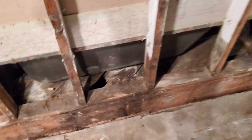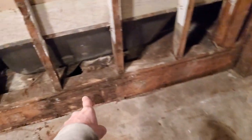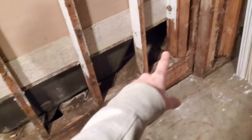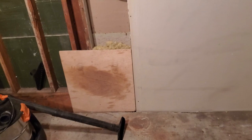Anyway, I didn't really showcase that for that reason. Let me give you guys a quick overview. You'll notice we've got some drywall right here — this is temporary. I'm going to take it off and insulate in there. I had to keep mice from getting out. There's a little gap in the garage door; a mouse could easily come in, get up into the crawl space, go up the basement stairs, and get into the house. So I temporarily put some drywall here and some batts so the pipe doesn't freeze. I put some mineral wool down in the cavities to prevent freezing.